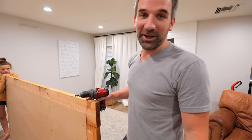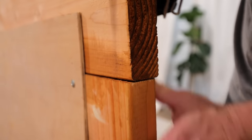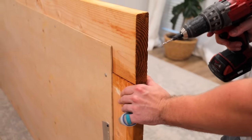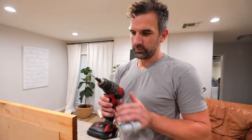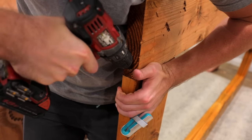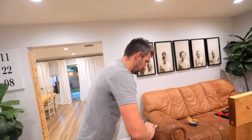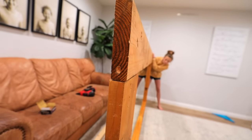We're going to anchor this down a little better because it's moving just a little bit, and we don't want that. Mike is going to countersink — pre-drill a hole for us. It just helps you guide your screw instead of winging it. We just don't want the screw to show, so it really gives it a nice look if you pre-drill your holes.